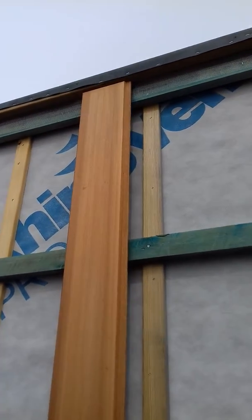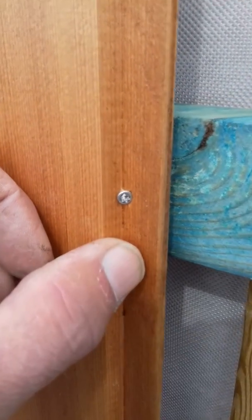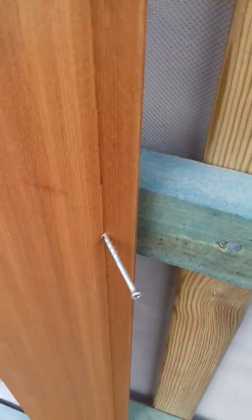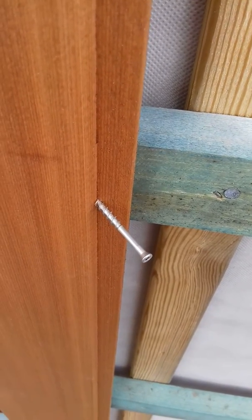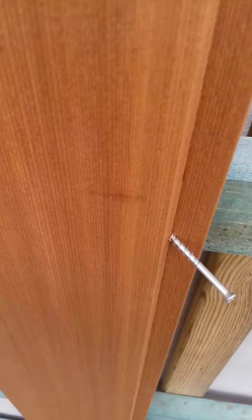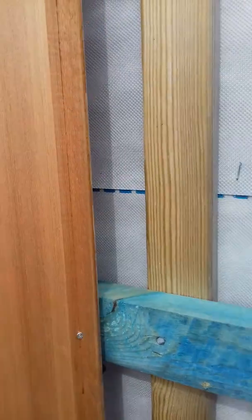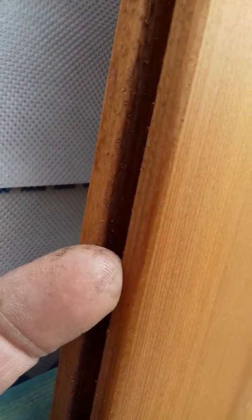Yeah, that'll be the board, fitted at the top, 10mm gap at the top with insect mesh behind. There's the stainless steel screws, quite small. We haven't countersunk them here because I'm going to take the board off again and then fit them, basically stick them in on an angle, that pulls that board up. If you're doing grandis, you need to be leaving them reasonably slack, but on this cedar here that's been pre-oiled, because it's all around the tongues and grooves and you won't be able to oil in here afterwards.